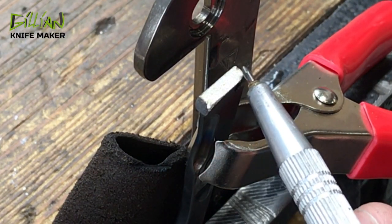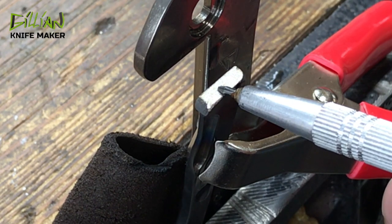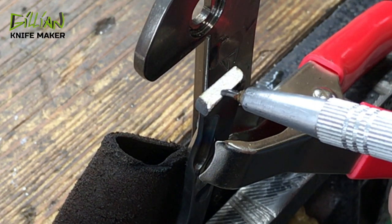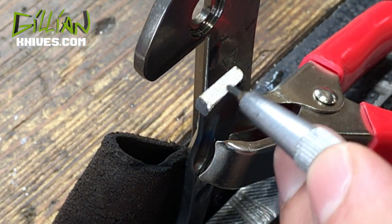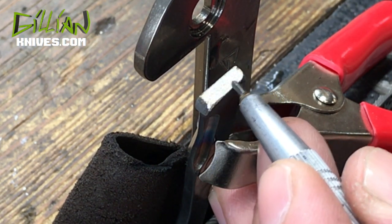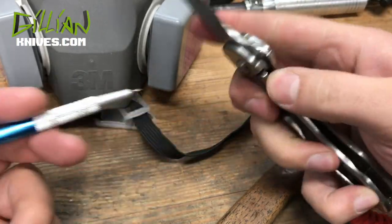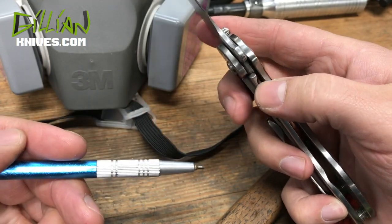This has micro-welded a layer of tungsten carbide on top of the work-hardened titanium layer, so now this lock bar is amazingly hard — 72C on the Rockwell hardness. The blade will no longer wear out this locking bar; the locking bar will actually put wear and tear on the blade. But by the design of the blade, as this knife ages, the lock will only seat itself deeper because our geometries are correct. We've made this locking bar highly wear-resistant and greatly increased the lifespan of the knife — preventing mechanical wear from the locking bar face constantly meeting the blade.